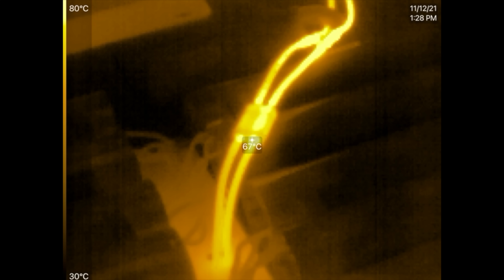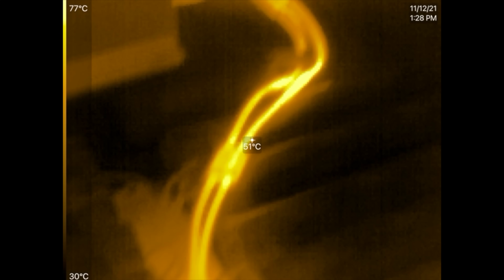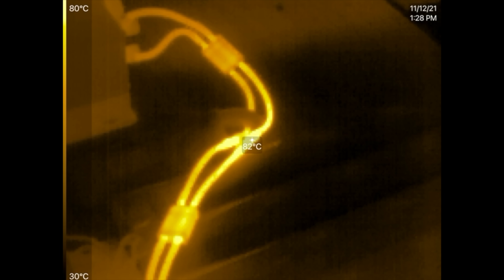All right, it's been about 15 minutes since I started this test and it's holding at 49–50 amps this whole time. The weakest point I can see is that exit cable — 60 degrees right there. At the exit point at 50 amps, then the XT90 is at 63 degrees, three degrees more. And right there at the actual contact it's somewhere around 68 degrees. This external cable — those other contacts over there are 80 degrees.